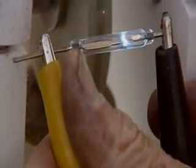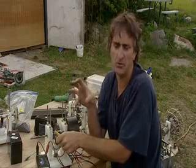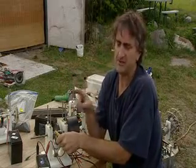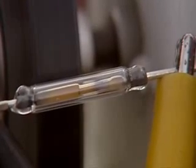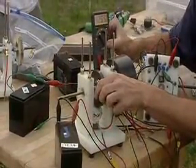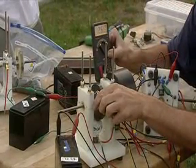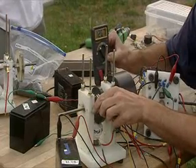To deal with that back-kick, conventional electric motor builders just ground it out, but what you want to do is put a full wave bridge rectifier — it's a component you can get at Radio Shack for a dollar fifty. It changes AC into DC. Look at that — here's the battery being charged. Watch the volts: 12.65 already, 12.66 — see it's going up, and it's going to go all the way up to 14 volts if you want.